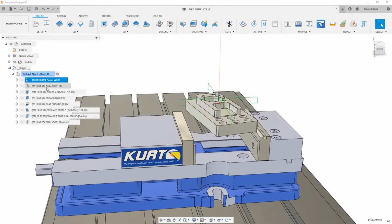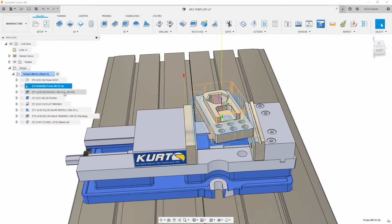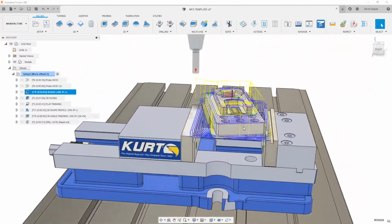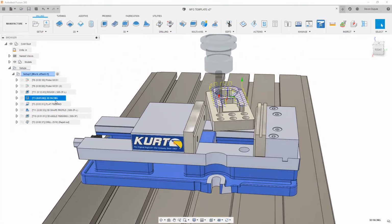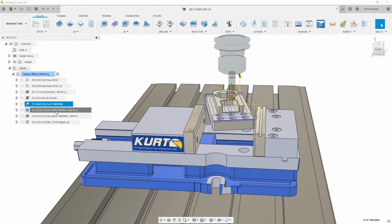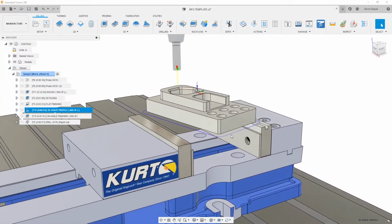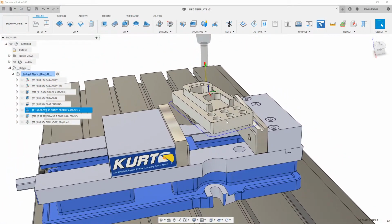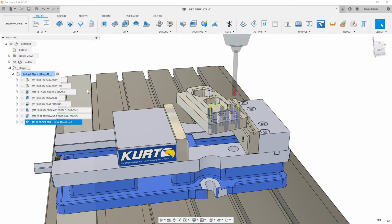This is obviously going to generate any of the stuff that didn't move, but for roughing our part out with our part now sideways, if that's how we wanted to do it, we just generated the toolpath like that and we didn't make any selections. So like I said, with any of my other stuff, the facing or finishing of any of the flats on here, all this stuff is based off of the part, this outside 2D profile that we have here. It's not like we're going through and changing this or selecting any of these. We're getting this output pretty clean just by doing the workflow that I have here.